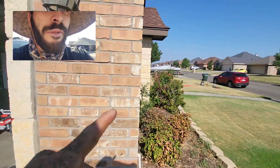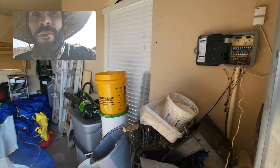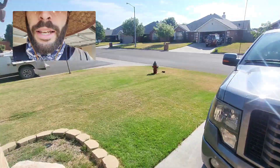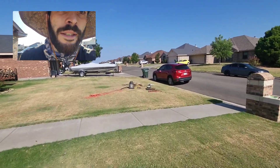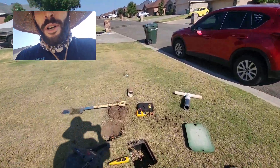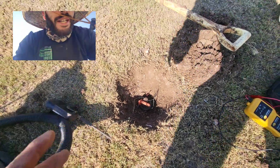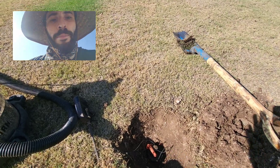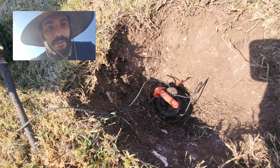I finished my repair in the back and I'm still waiting for it to dry, so I can't turn the water on yet to figure out where my master valve is. At the controller, my master valve is on the black wire. I didn't wire-locate — I just made an assumption. I went over to the water meter, located the backflow prevention device, and right after the backflow was my first control valve.